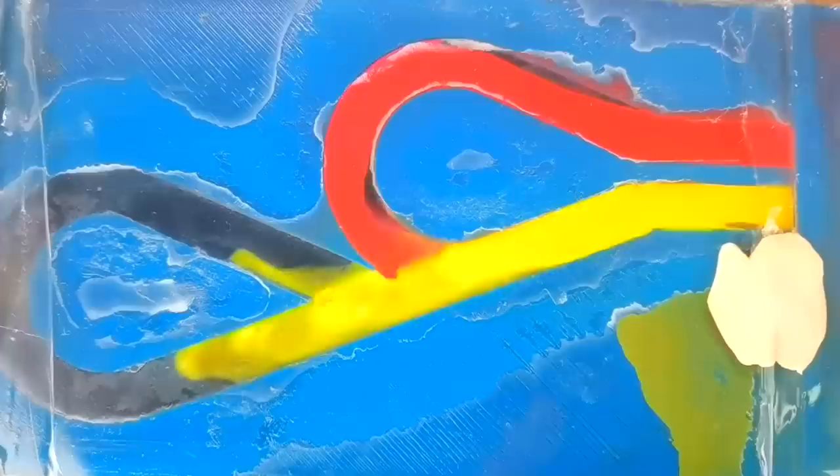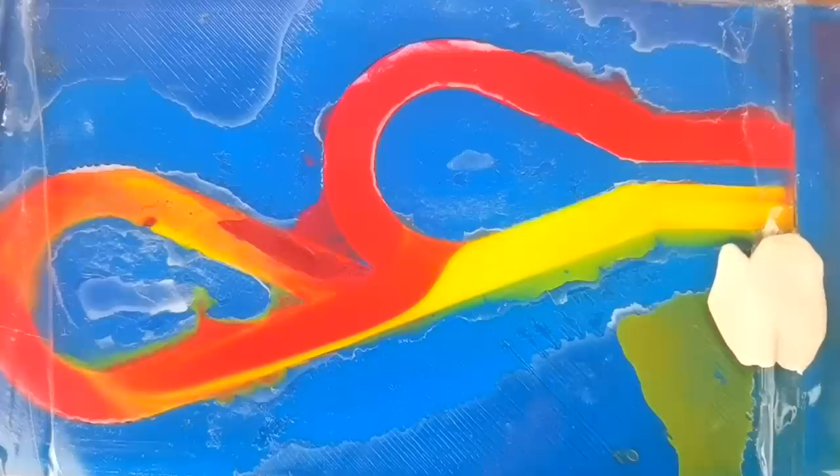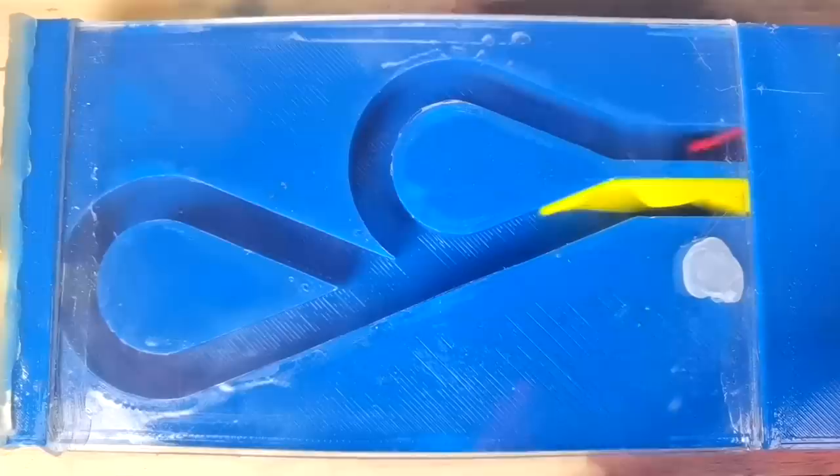Let's see how the footage is. As you can see, the red stream that represents a counterflow pushes the main flow off course into another counterflow, which increases the distance traveled and the degree of resistance offered by the valve. The more modules you stack up in a valve, the better it will work. These tests were done in the reverse direction, or direction of most resistance.